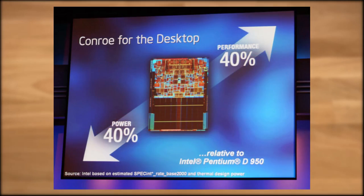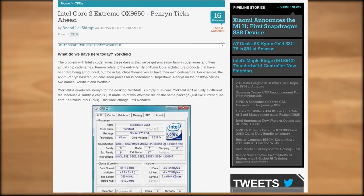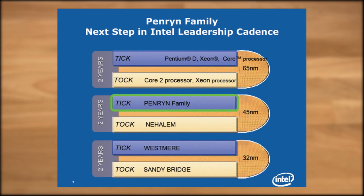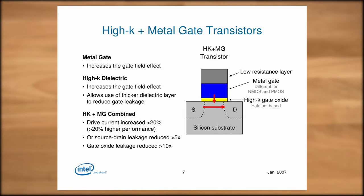And while these were light years ahead of NetBurst in terms of efficiency, they still consumed a fair bit of power. About a year later Intel updated their Core 2 Quad lineup with Yorkfield, which now had two Penryn dies. These new chips included quite some rework to the old Conroe architecture and had a node shrink to the more efficient 45 nanometer process, which now used high-K gate oxide and metal gates. With this they were now able to improve efficiency enough to select a very few high-quality chips for use in laptops.